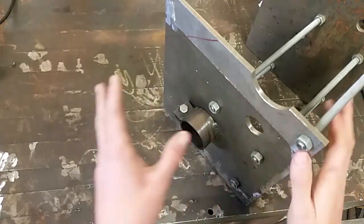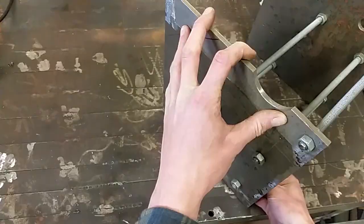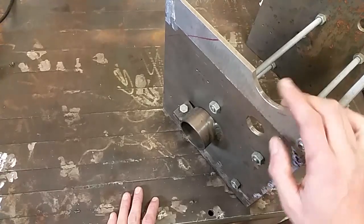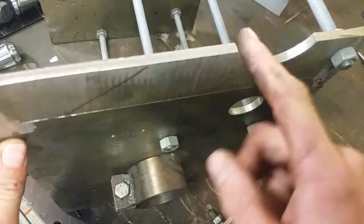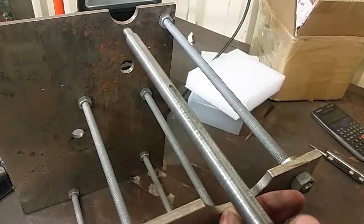The gearbox is going to be plated in with covers and I'm going to have a support underneath it from the bench. This gearbox is going to be a significant cantilever on the back of the lathe — it might distort the ways and throw the headstock out of alignment with that huge weight behind it. You'll notice at the top I've got this dished section bored out so that when I've got long rod stock sticking out the back of the headstock it can actually pass through here.